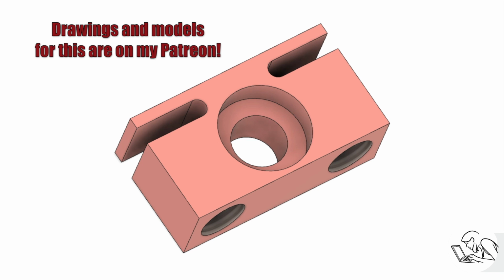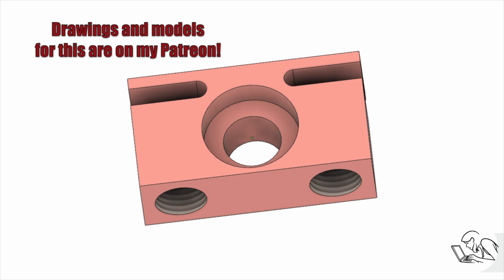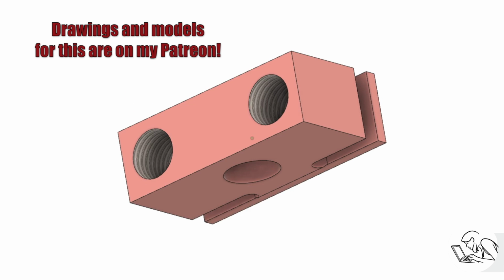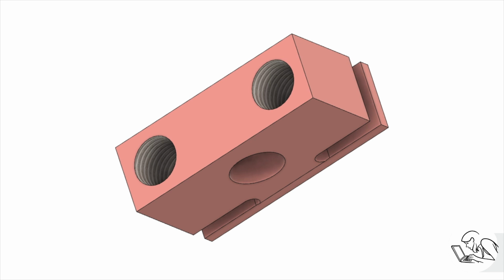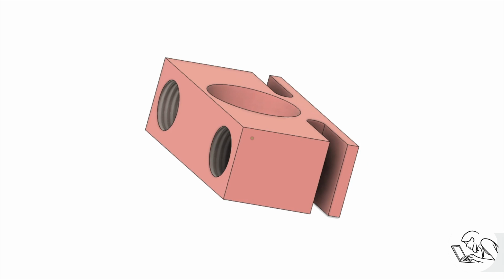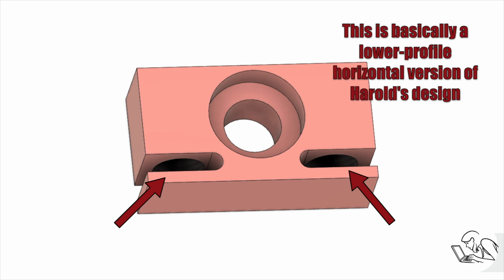Here's the design I came up with to hopefully solve this side clamping problem. So there's a large countersunk hole in the middle for a bolt that goes into a T-nut. So this whole piece clamps directly to the table, and then there's threaded holes in the back for set screws, and those set screws press on these plates at the front, and these plates form a flexure effectively that supply the clamping action to the part.